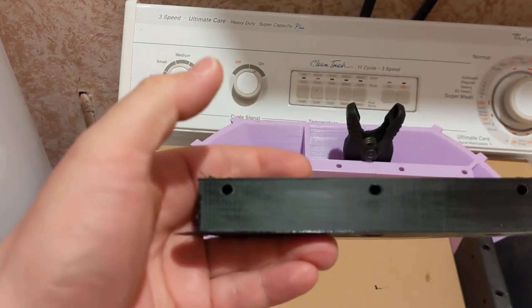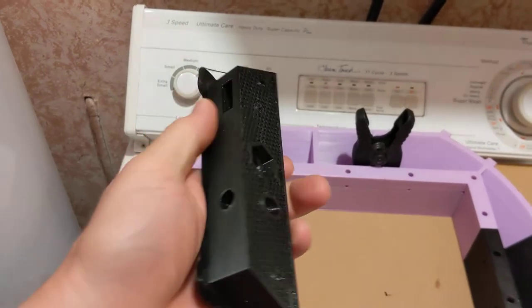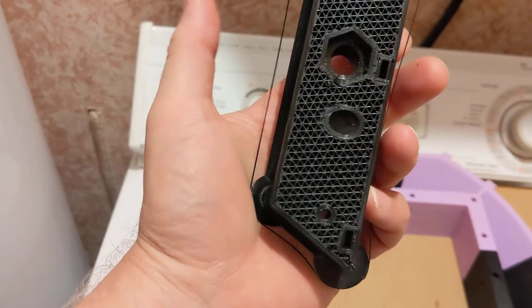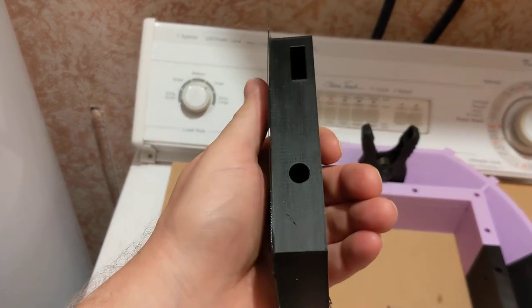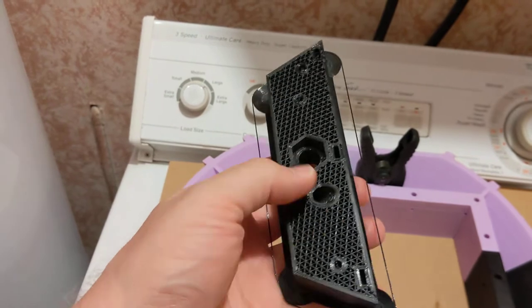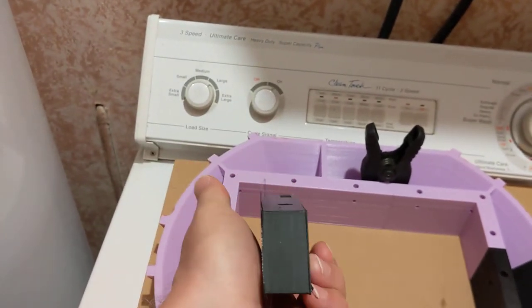This piece for frame A, for drive A side, is a little bit warped because this side came off a little bit, but looking at where it's situated in the build, I think the part that shows the warp is on the outside of the foot, and I don't think it will structurally have an impact on anything other than maybe the foot shell won't be flush up against it. Maybe there'll be a little bit of a gap where it's warped, which if that proves to be an issue, I could probably put Bondo, just a light coat over the little bit that it's off where it's warped.